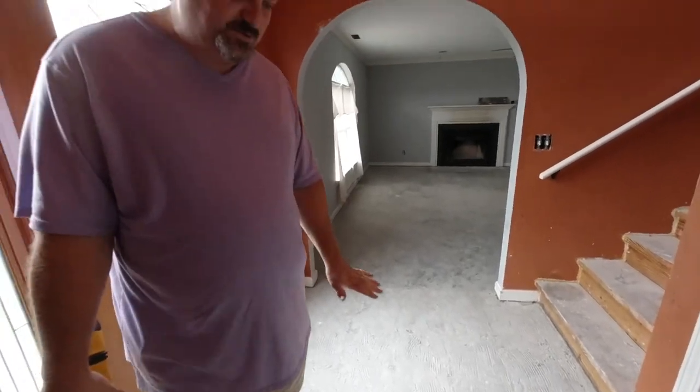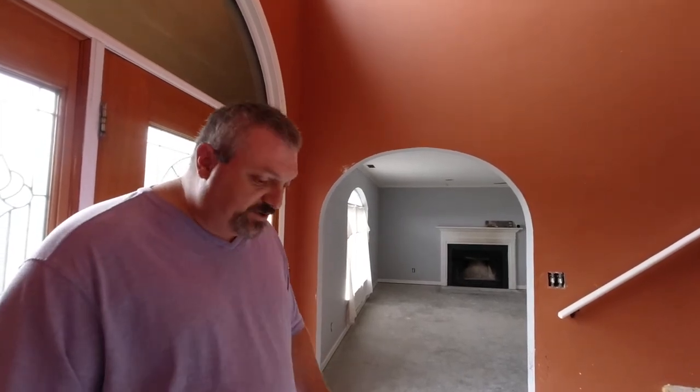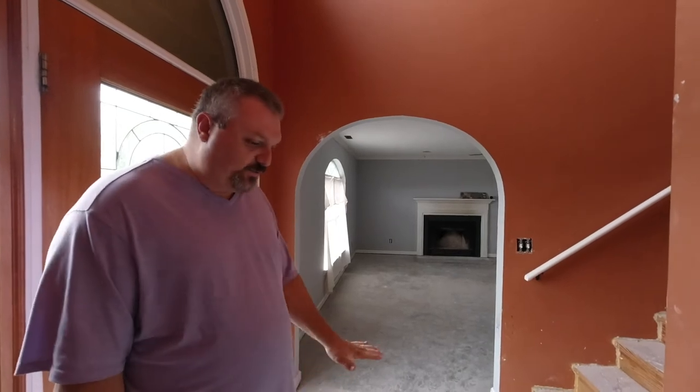You can see it does still leave the mortar. If you were laying something smooth over this like a vinyl, you would have to come back in and do a little more chisel work to bust this mortar up. We're not — we're doing laminate flooring. It's 8mm thick with a 2mm pad under it, so for what we're doing this mortar won't affect us. We'll sweep it up and clean the debris, but for the new flooring we're installing this will work well.